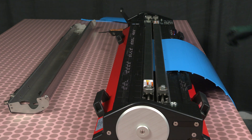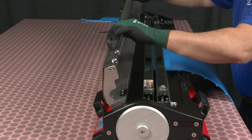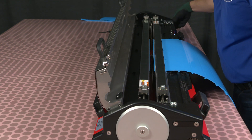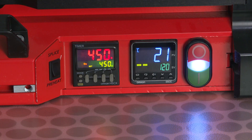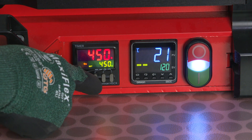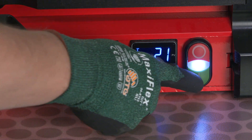Once in adjustment, install the heat shield, pull back the actuating lever to raise the emitter and then close the heat shield. Switch the Amigo to preheat mode, set your preheat to 300 seconds, and start the preheat process by pressing the green button.